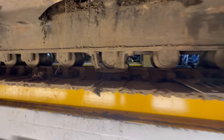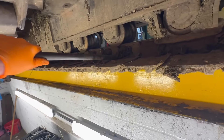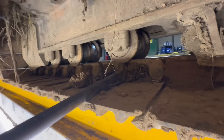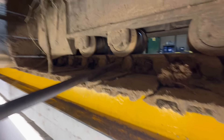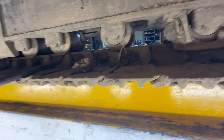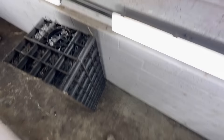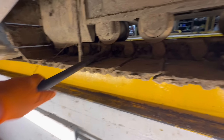This gives us a good opportunity as well. If you can see these rollers here — I'll get my iron bar with the hook on the end and we can give them a little turn to make sure there's nothing wrong with them. Usually you'd have to do it from the other side and get on your knees, whereas here I'm completely stood up. So check all of them — they're all right.